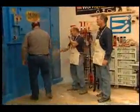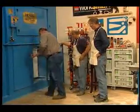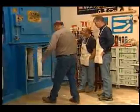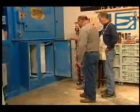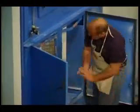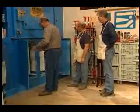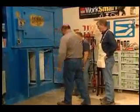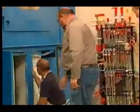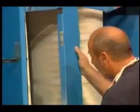All right, great. So really, tell us what this is all about. In here is a filtration system. Look how much dust it's already captured. That is incredible. And now this is just from tonight, from when we've been running stuff. Well, we played around a little bit this afternoon. But the thing of it is the dust enters here, through here on each side. It comes up into the filtration system. And then as the filters pulse, it drops all the dust into the drawer below. And so your basic maintenance is to just pull out the drawer and dump it out.